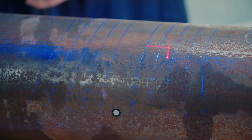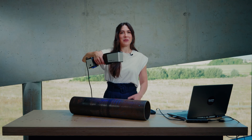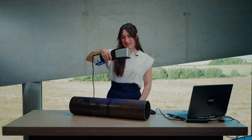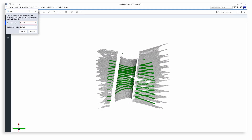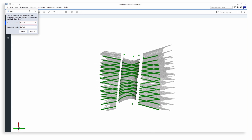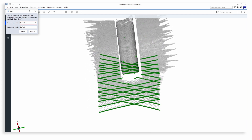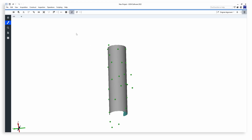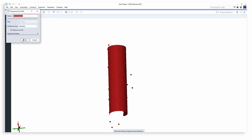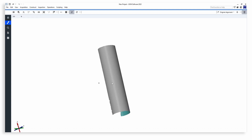On the part, you will see blue laser lines projected next to a red crosshair. This supports you in maintaining the right working distance. The correct distance is also visualized directly on the laser lines in the software via distance radar. Blue means too close, red means too far, and green means the perfect distance — and we also see how to orientate the scanner to the part. The last step is to choose Finish Scanning and Polygonize by hitting the finish flag. After this, the scanning is done and we are ready to use the mesh for reverse engineering or for inspection.